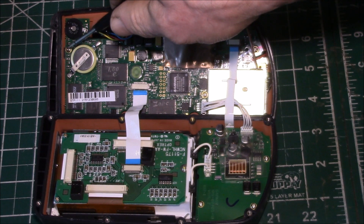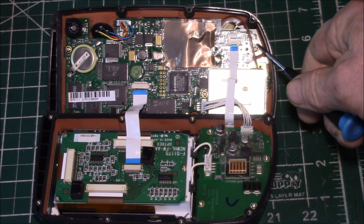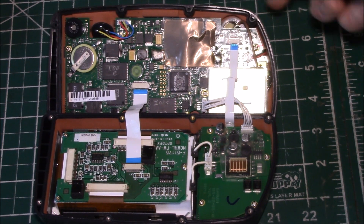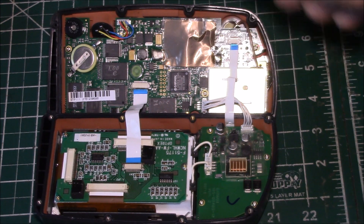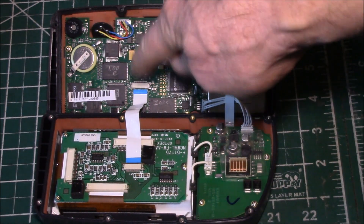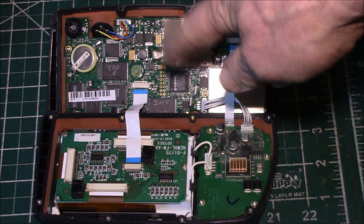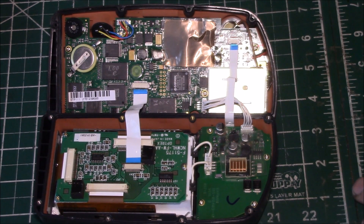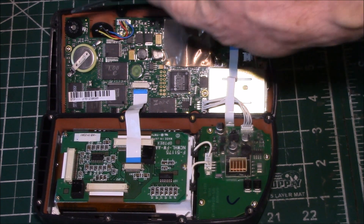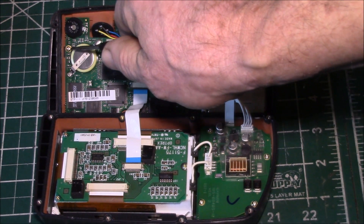So that must be a ground connection. There was a bare copper pad under the screw, and maybe it connects down below because this one also has a copper pad under it — so that's probably the ground plane connection. The last time I used this it kept saying low battery even though I had just charged the batteries. I got it running long enough to find the geocache, then charged the batteries again — they were all at 1.2 volts and fully charged — but it still wouldn't turn on. I bet that screw had worked loose and was causing the low battery reading.